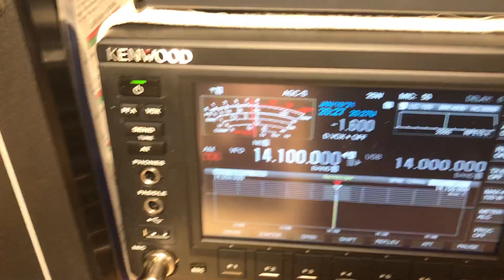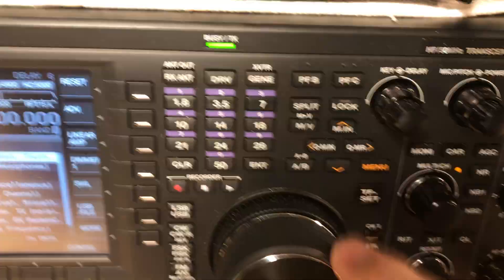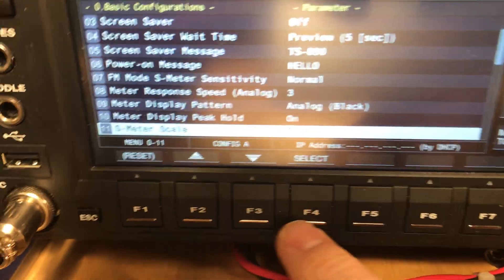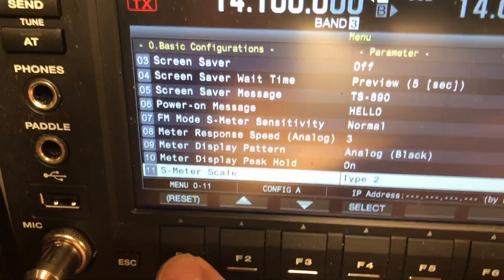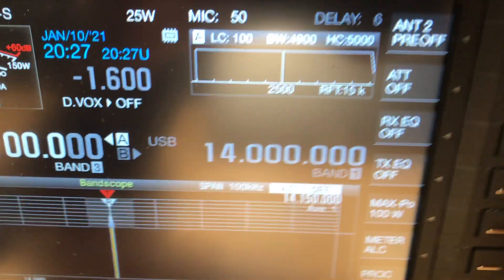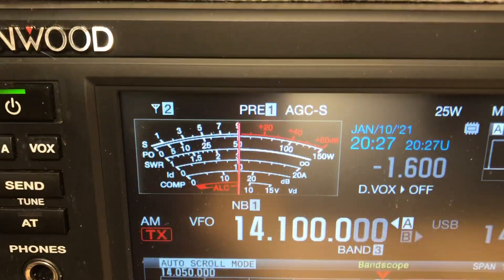So there's the S8. I'm going to move the lid here. He says go to menu - so we go to menu. There's item 0, they're in categories. I'll hit select, and wheel down to number 11 - it's already there. And there it is: S meter type. I'm going to hit select and increment to type 2, and that's the enter key. From there I can hit escape. Then he says go to preamp 1 - which is really odd, why they do that I don't know. My preamp button is right here. Antenna 2, preamp 1. Okay, and guess what? Bada bing - S9, just like that.